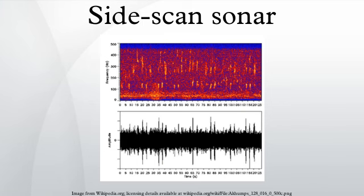Side-scan sonar imagery is also a commonly used tool to detect debris items and other obstructions on the sea floor that may be hazardous to shipping or to sea floor installations by the oil and gas industry. In addition, the status of pipelines and cables on the sea floor can be investigated using side-scan sonar. Side-scan data are frequently acquired along with bathymetric soundings and sub-bottom profiler data, thus providing a glimpse of the shallow structure of the seabed. Side-scan sonar is also used for fisheries research, dredging operations and environmental studies. It also has military applications including mine detection.